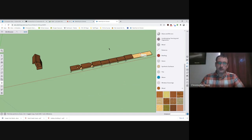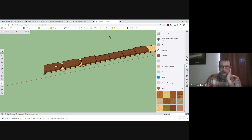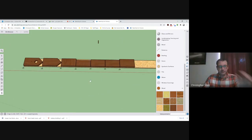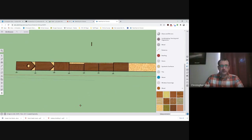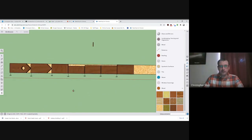Now I've got quite a bit of this board left. I'm wondering: can I get away with using a six-foot board instead of an eight-foot board? This is one of the nice things this exercise brings into play — could I buy something smaller and still have enough to make the project, save a little bit of money and time? I'm going to rotate my view to get it pretty much straight up and down. My computer's a little slow because I'm running Google Meet at the same time, but I'm moving my view so it's straight up and down.